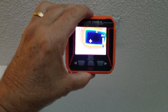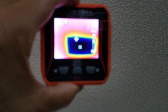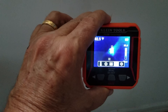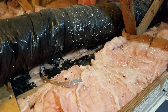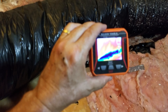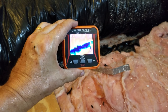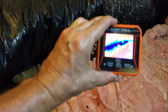Here's the register that's sweating so much. As you image it you can see there's a cold spot in the middle, showing that it's coming out at about 47 degrees. Sometimes you'll have little holes in the drywall where something pokes through — you can see that hot spot on the wall there, peaking at about 84 degrees. Now watch this — with the Klein Thermal Imager at the bottom of this flexible ducting, you can see the dark blue area where it's super cold compared to everything else, showing about 74 degrees versus around 94–97 degrees in other sections.